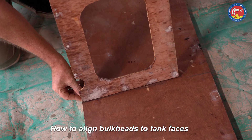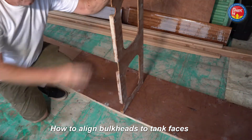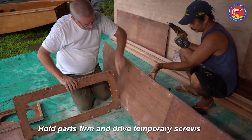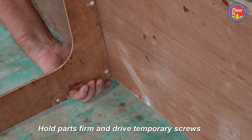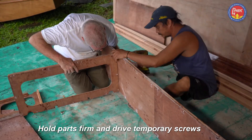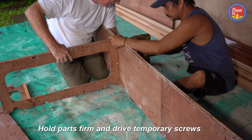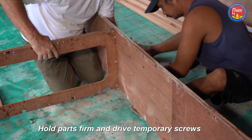They'll look something like this. Now we know where the lines are and know it all fits together. My job is to hold everything perfectly in line so those bottom corners are exact matches. We're not worried about the framing — we're worried about the plywood only. We'll screw them together. All the accurate measurements are given by plywood in this boat; the framing is just to hold the plywood together.